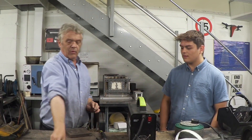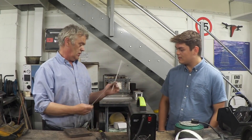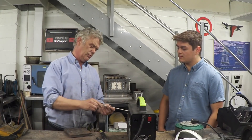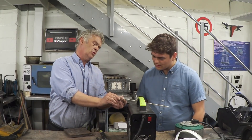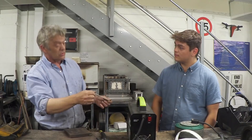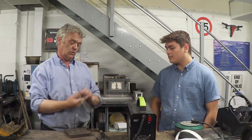These are the welding rods and there are two thicknesses: thick one for thick metal, thin one for thin metal. They all have a number at the bottom — E6013 — that is the general rod you'll use for welding steel more or less all of the time. You can get different rods for different jobs, but 6013 is the one you want.